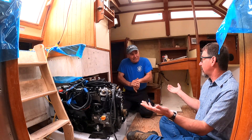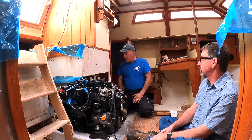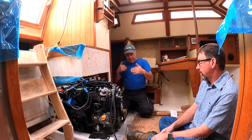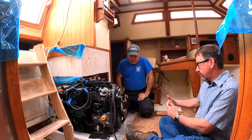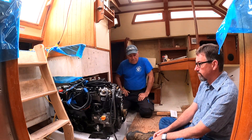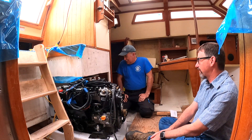The serviceability — that was your key, our key. You put this boat out on the ocean and my main deliverable was I wanted an engine that I would want to work on, and this is it. I'm sitting right here next to the alternator, the seawater pump, the starter is in here, the exhaust elbow to maintain in the long run — it's a piece of cake. There will be things that are in the way, but we'll have it so that you remove maybe 10 screws, take the entire panel out of the way, and there it is. The old one was out to here, so we moved it back 18 inches. This is a skinnier engine — only about three quarters of the size of the old one. So it's lighter, more horsepower. Couple that to that big Max prop, this thing is going to drive very nicely in our great Northwest sailing conditions.